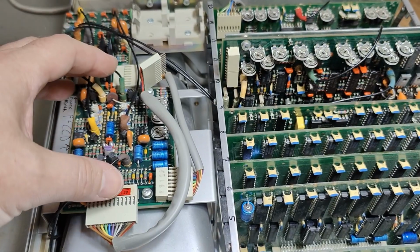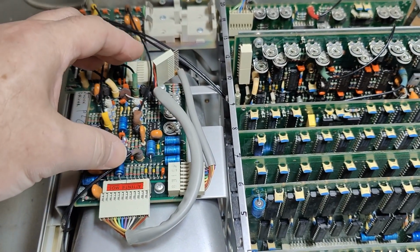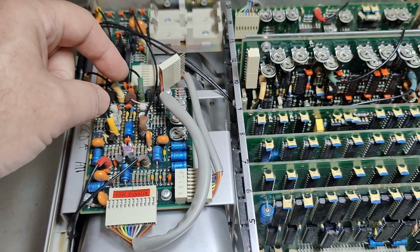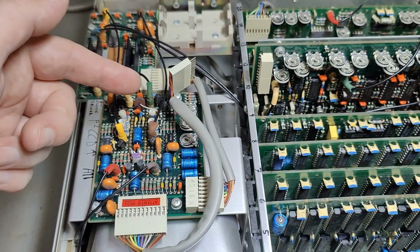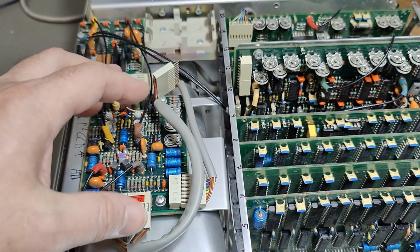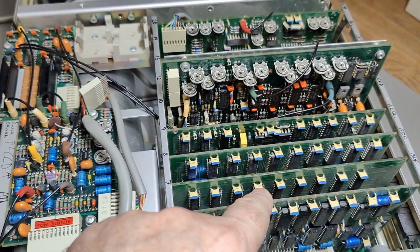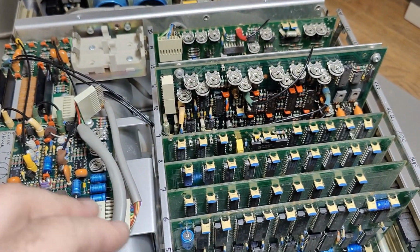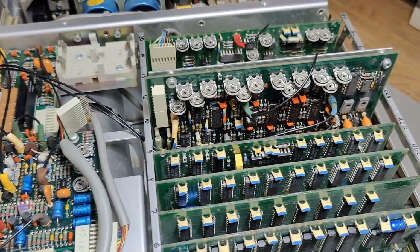But definitely they're storing very high speed analog pulses into 2 times 128 bits. And then it will be slowly clocked into the AD converter. So that is why you can go this fast. It's a very complicated way they've done this, by the way.